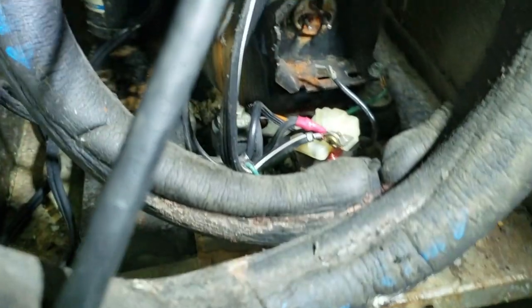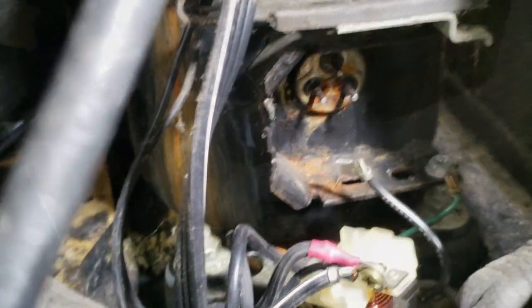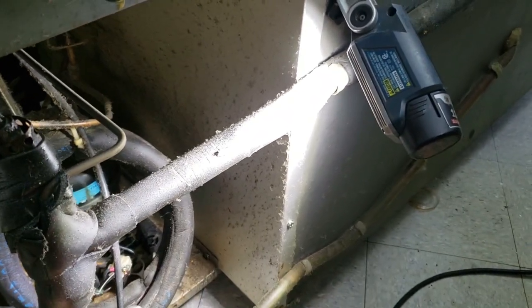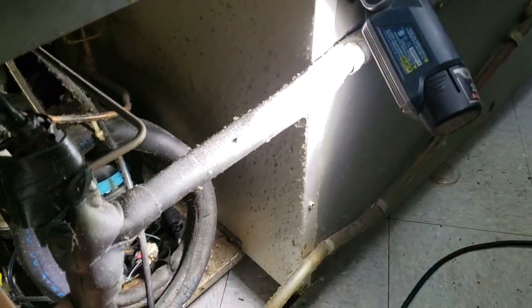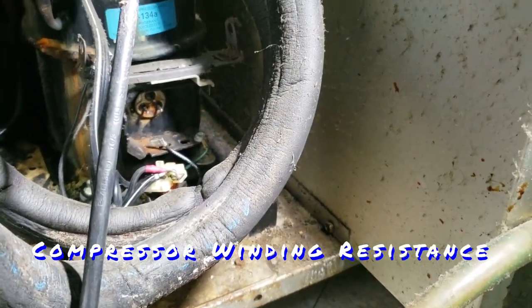So that's moving back and forth. Going directly to the terminals to see how she's doing — I'll check for grounds first. These are actually pretty decent units. I know some Pizza Huts and a few others use them. They actually have a dedicated evaporator for the top rail and a dedicated one for the bottom box area, which makes them do a lot better job than most units that try to do it with one. They're decent units, though I don't care for the pressure control for temperature — that's kind of a pain in the butt sometimes.